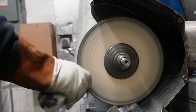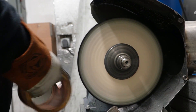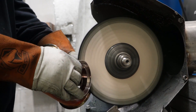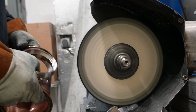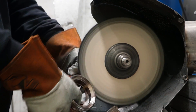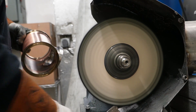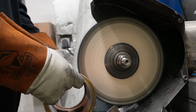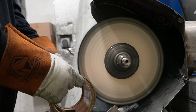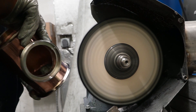When everything's said and done, hopefully you look a little something like this. Now that's looking a little messy — not the weld itself, but we need to go ahead and start buffing. We're going to hit it with the buffer, starting with our window. That wheel likes to grab, and around that circular pattern it's just a little hard. We're going to hit along the edges and then do that same cradle motion back and forth for the inner section. Don't forget to repeat the same motion you saw on the sander for the tri-clamp ends. Through the buffer, we're going to be removing all our weld marks, and it's just going to come out looking really clean and shiny. Don't forget those ferrules — you've got to hit those ferrules.